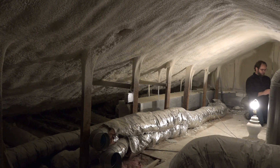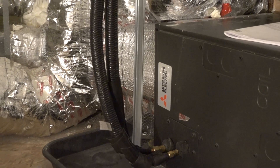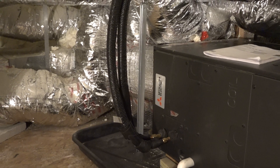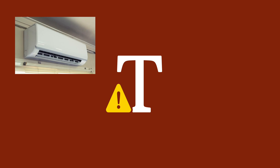Upstairs in the attic, where we foamed the whole lid and made this thing super tight, we were able to put an air handler — a traditional forced air cooling system providing cooling to the second floor. Very short duct runs, easy to do, easy to balance. And because our BTU load overall went down, we're able to use a fairly small Mitsubishi air handler up there. When it comes to the first floor, we don't really have a great way to bring enough ductwork down to provide cooling. And I don't particularly like ductwork — it usually gets pretty gross in there, and people don't clean it as often as they should. So the other way to bring cooling into a house is with mini splits. But when you say mini splits, oftentimes people's first reaction is they don't like the wall unit — the thing that sits on the wall. Mitsubishi came up with a really brilliant system to bring mini split cooling into a space without having that wall-mounted unit people object to.